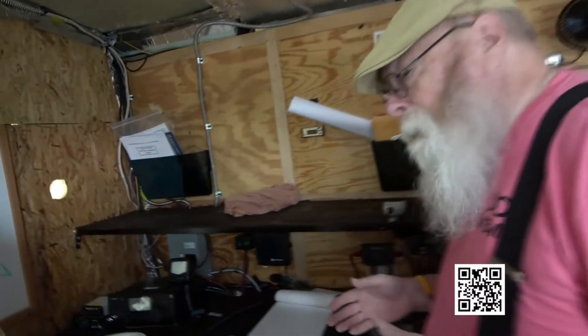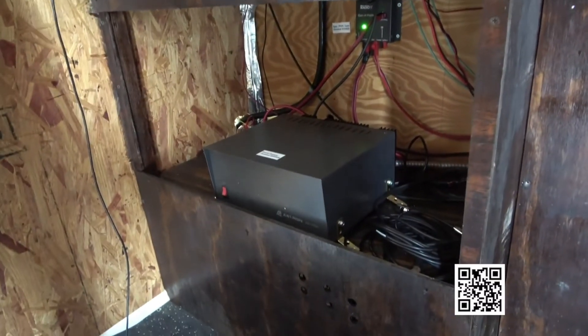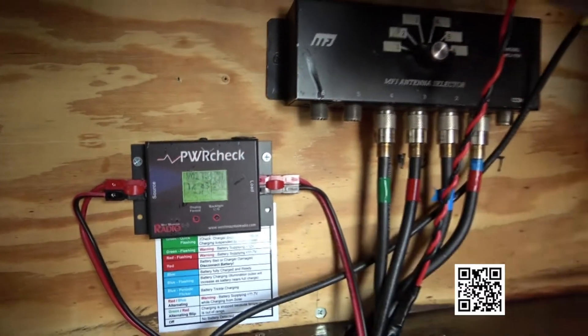If it's not being used out on the net, it's being stored in the batteries. The power itself comes from down here where the batteries and the regulator are. It comes up to a checkpoint where we can tell how many amps it's drawing, how many watts we've got, how many volts we've got. It comes back out and goes down to a power strip. We've got two power strips on this thing that support lights, radios, and other 12-volt items within the system. The power supply block is located down here.